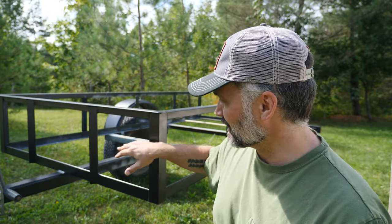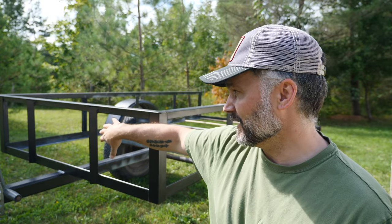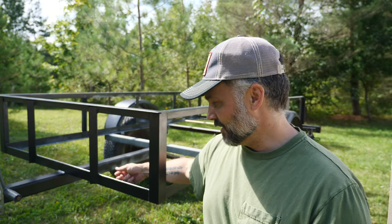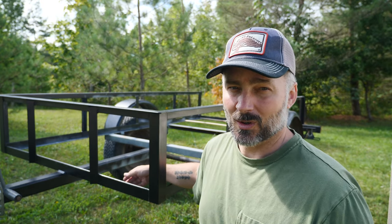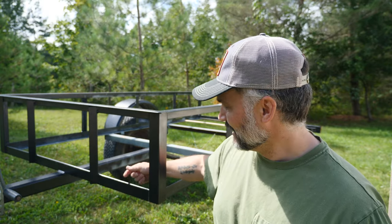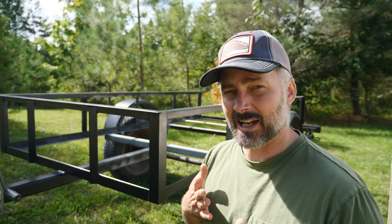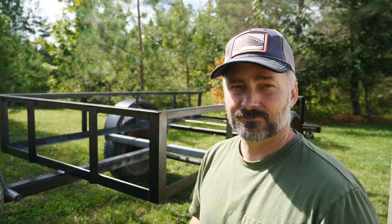What I'm concerned about is that water, like rain, is most likely going to hit the side of the tiny house camper and run down, and then it will go between the steel and the wood, and it could pool or just sit there and rot out the bottom of the camper. So my plan is to put a small amount of fiberglass in that bottom corner all the way around, and then up the side edges as well, so that'll stop rain from getting in through the seams, but also hopefully prevent any rot down the road.